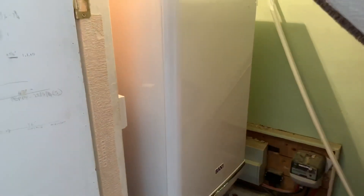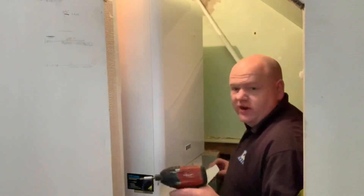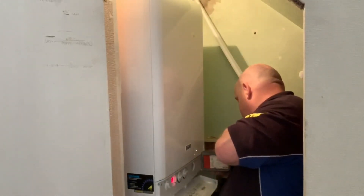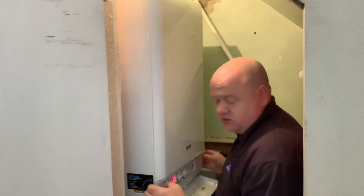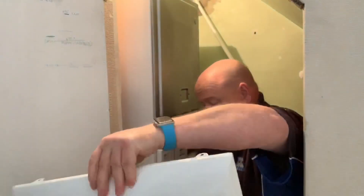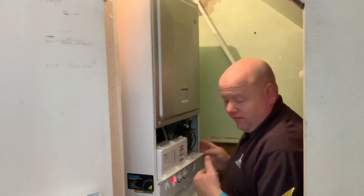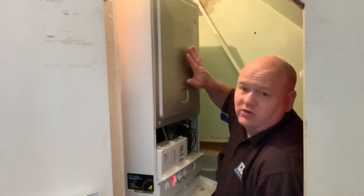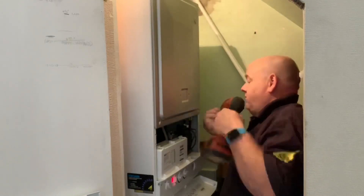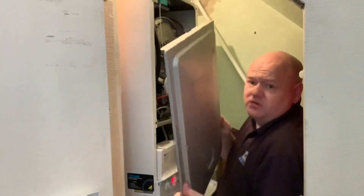So let's have a look inside this boiler and see what's good about it. It's a little bit tight in this cupboard so I'll just try and do the best I can. To take the case off on these, just undo two screws — you don't need to fully remove them — and that cover just slides up. The bottom flap is still in place; if you want to lower that, remove these two screws here. But first we'll have a look inside the combustion cover: undo these two screws and it just lifts forward, lifts up, and comes off nice and easy.